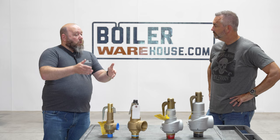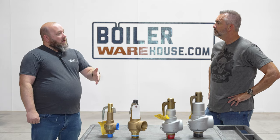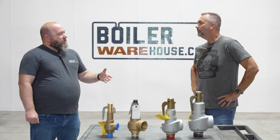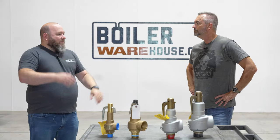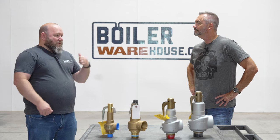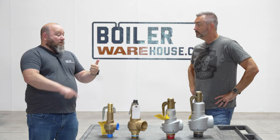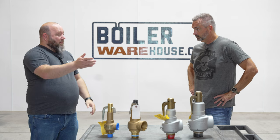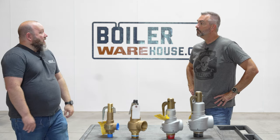With these relief valves being mounted on the boiler — Section 1 relief valves — they will start to relieve within 3% of the set pressure. So you can't butt up against where you're operating versus where the valves are set. You've got to plan out: what is my operating pressure? And if I'm going to stagger them, how am I going to stagger them, so I'm not popping relief valves when I don't need to be?